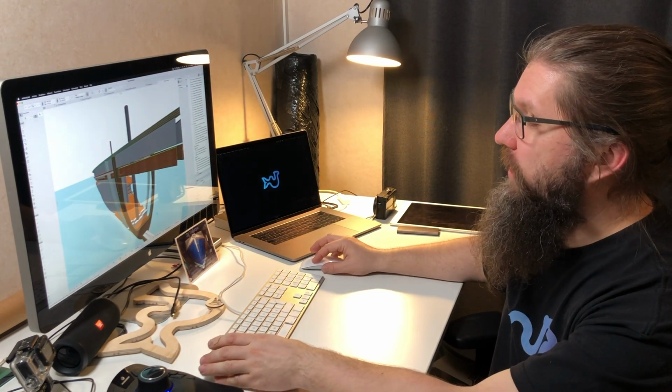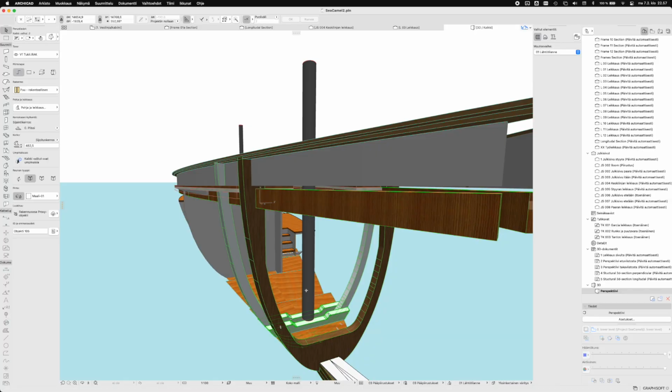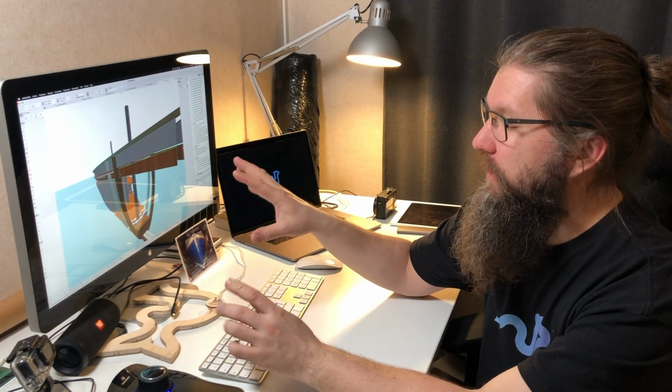But all right, I think I'm not gonna continue right now forward with these frames, because in a few days I'm expecting some more material from the Naval Architect, especially the mast steps and the keel steps, and some additional information of these floors, these parts here. So they will affect quite a lot of these frames, so not gonna waste time on those right now. But I think what I'm gonna do is to actually try to manufacture this first frame quite soon. First, I'm gonna do some kind of test assembly or test arrangement and try out this method of laminating these frames, because I have never laminated a wood composite structure with epoxy before. So I think I'm gonna try something before I do major structure things for the ocean going vessel.